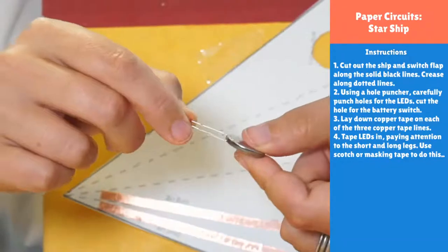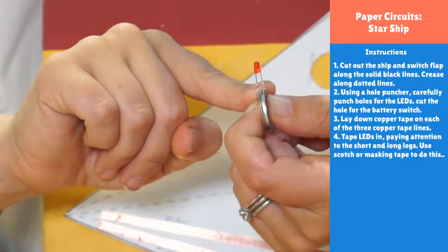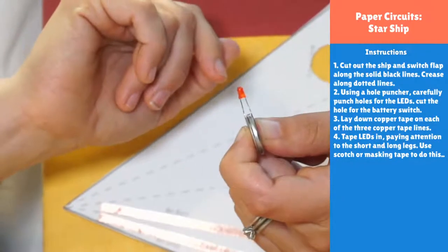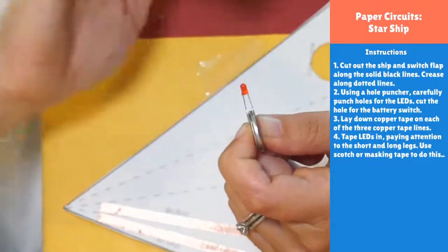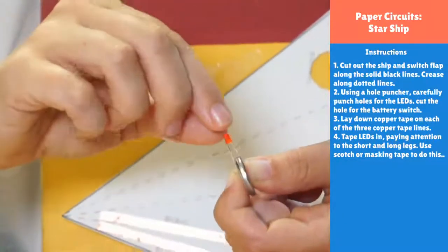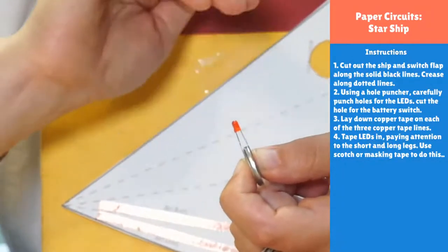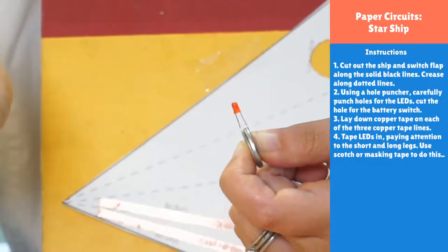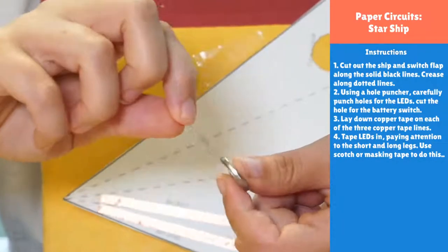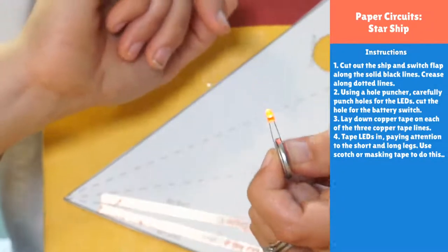I could also put the LED on where it's straddling it, and we have one on top and one on bottom, but it doesn't work. And that's because LEDs are called one-way streets. They're like these little slides. The electrons climb up the slide, they slide down, whippy, and they make light. However, electrons are super good rule followers, and the one big rule of the playground from parents is usually don't climb up the slide, and the electrons will always stay at the bottom. So if you have the slide the wrong way, they won't do anything. And if you flip it around, your LED will light up.